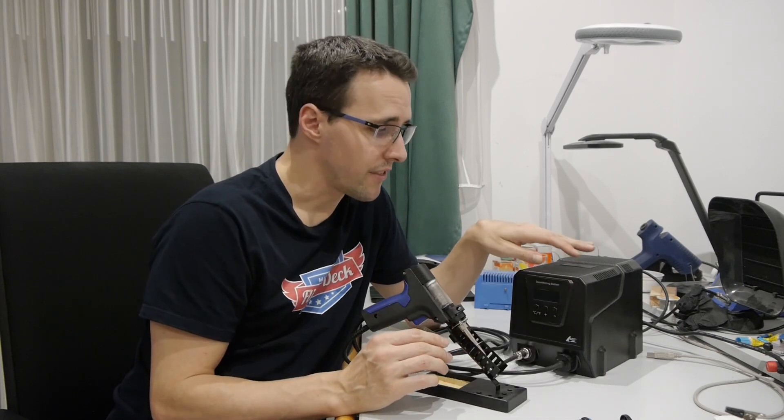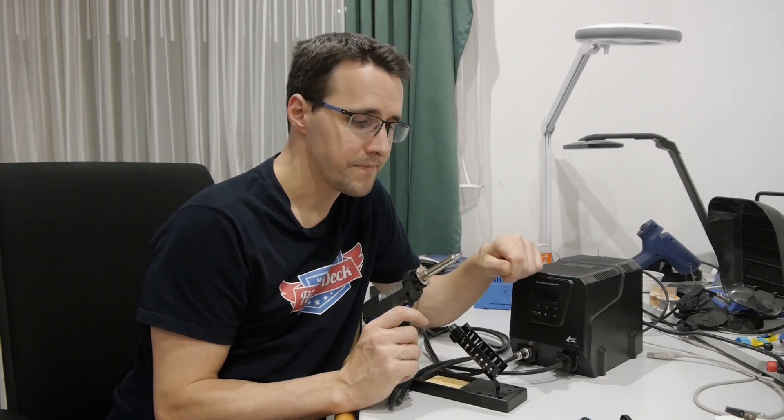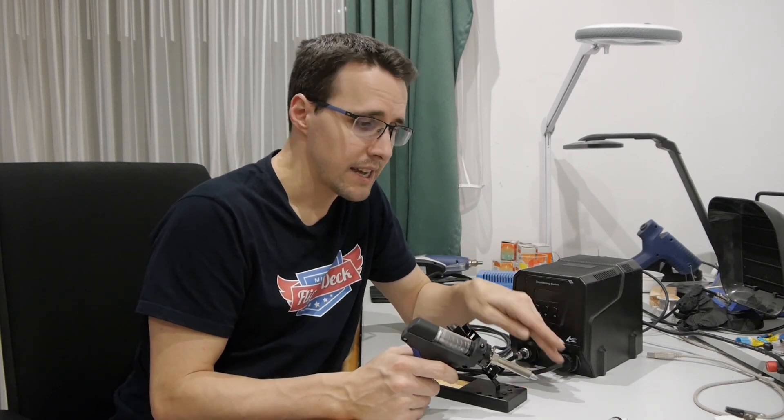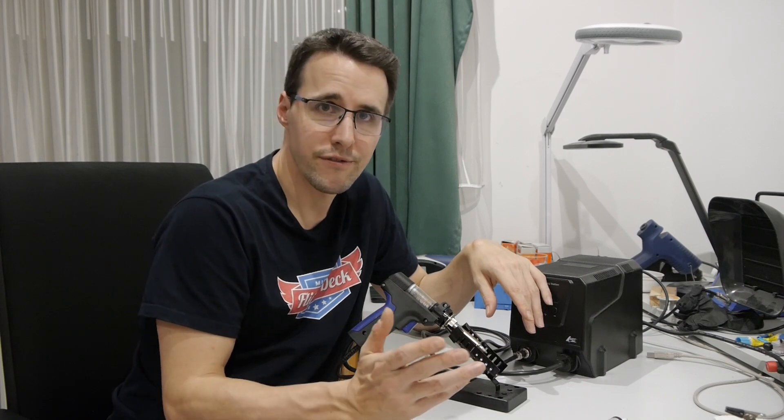This was a problem when I was desoldering seven-segment displays from a PCB, and this desoldering station was such a game changer. The station has a pump inside and a soldering iron with a hole in the tip. When I press this button the pump starts running, and because the iron is hot the solder is already liquid and is pumped away continuously — something you can't do with a manual desoldering pump. This technique has really helped me desolder seven-segment displays or even bigger components from a PCB.